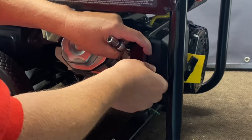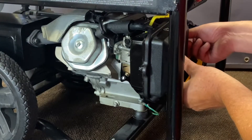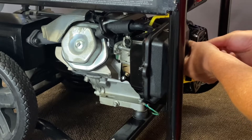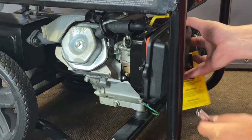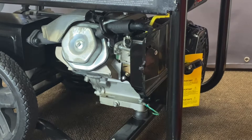Occasionally I will be in the way of the camera — it's kind of tough to get up in there. I'll go ahead and remove this side here, and then we can get to the air cleaner. Pull that off, pull the filter out. What we're going to do is go ahead and take the two studs off the back plate to expose the gasoline carburetor.